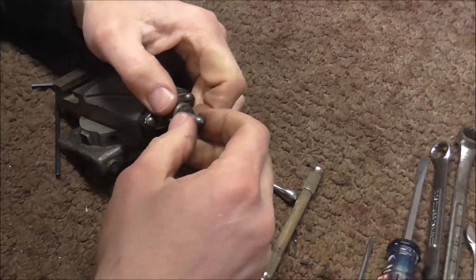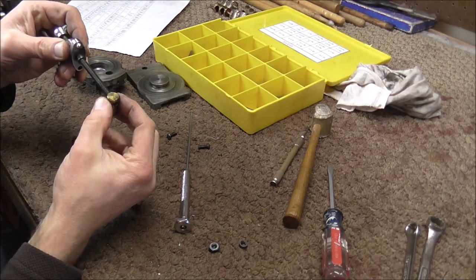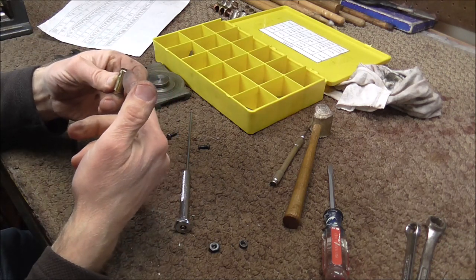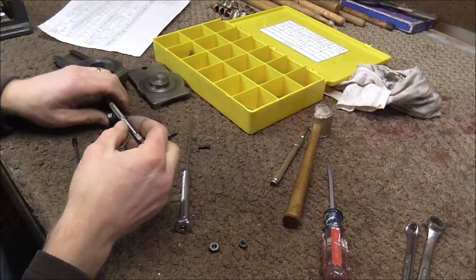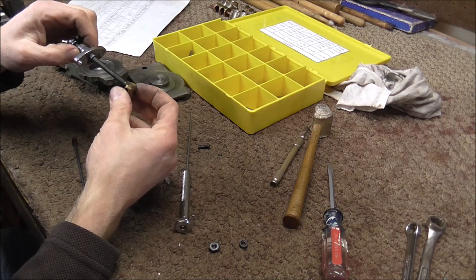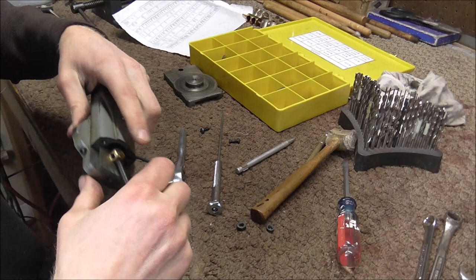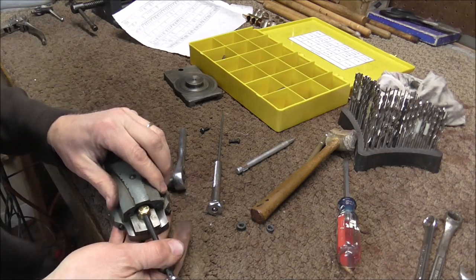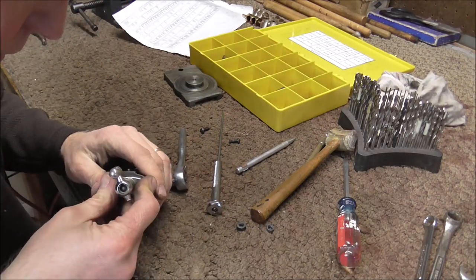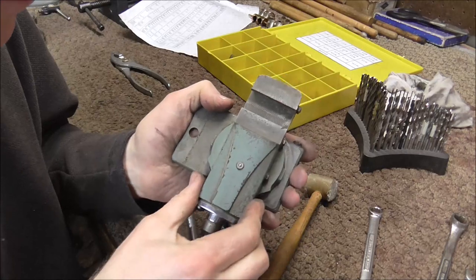This has turned out not to be quite as hard as I thought it was going to be — I should have done this years ago. I took some more parts off and found that this piece was loose and going back and forth. This is the piece that holds everything together, so I'm going to drill a new hole in this piece right there and then tap it out — I believe it's this tap, and that looks about right. I drilled the hole and tapped it with the appropriate tap, so that is done. I put it back together, screwed everything back in, and this is very tight now — it's not moving in any direction. So this is done.